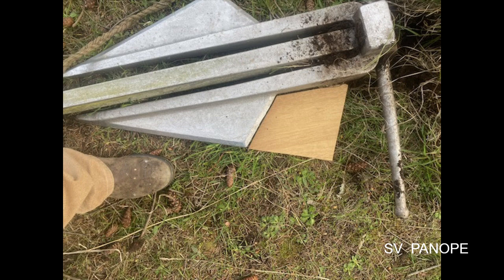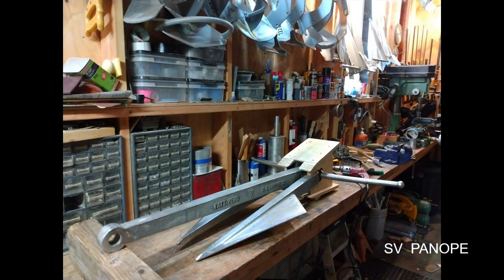His second option is to continue with his proposal to expand the size of the flukes. I don't think that will help the soft-mud setting issue at all — in fact it might make it worse. It could also worsen the clogging issue in the sandy mud seabed. Keep in mind the fluke area in that plywood position is near the surface of the substrate, and the higher up you go in the substrate the less holding power it has, so it may not add much holding power even in the best case. His third option is to go ahead with my idea to add mud palms. There's no question it will help and basically solve the soft-mud setting problem, though it's possible it could worsen the clogging and pop-out problem in sandy mud — so it's probably wise to retest without palms in the sandy mud first.